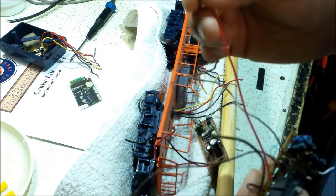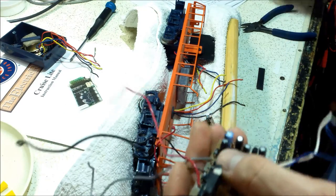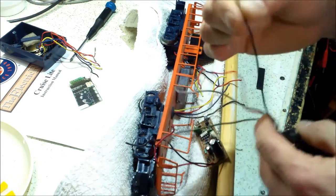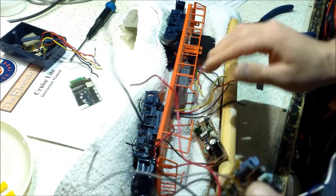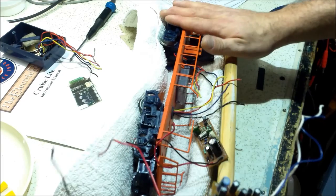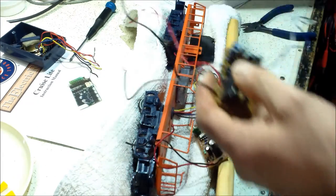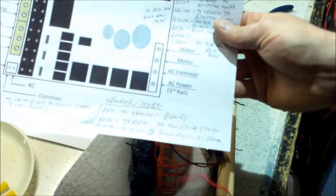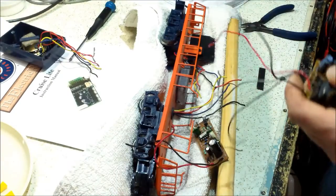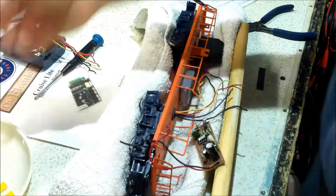Interestingly, the red wire went to the rear motor and the black wire of the front motor — so it was kind of backwards. I made a little sheet noting the wire colors in case you need that information, though they may all be a little different. I'll set the e-unit aside. This is the sound board — it has two pins connecting to the speaker, plus red and black where the red went to the horn switch and the black to ground.